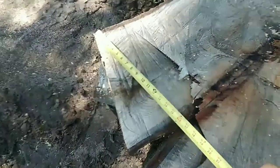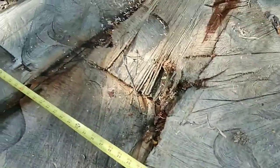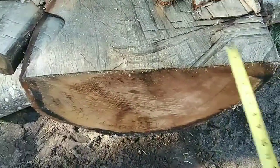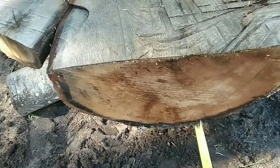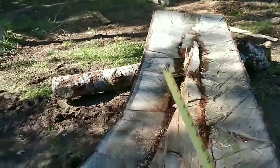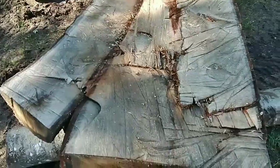So what I'm going to do is cut this lengthwise again, and then mill both parts as separate milling projects. I'll quarter saw this log so I end up with quarter-sawn oak, and then this section will be plain sawn with that crotch figure in it. I'll get this marked out and show you what we're going to do.